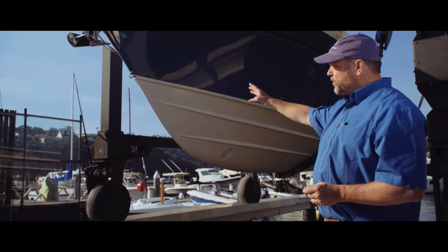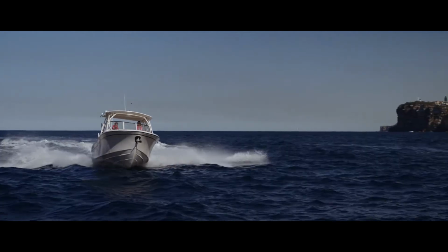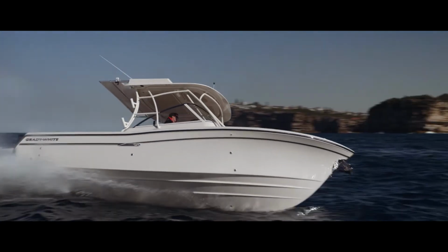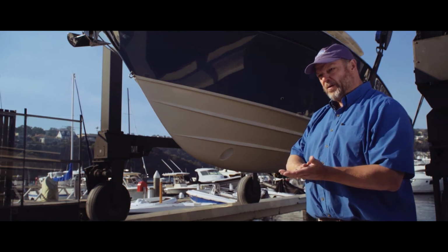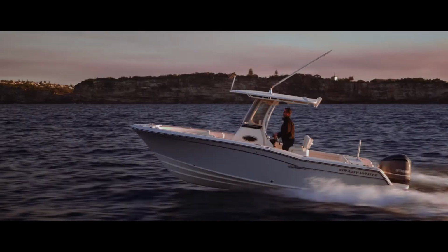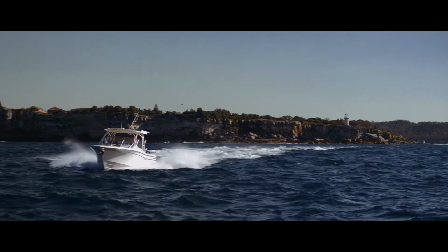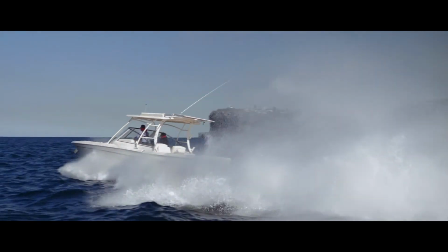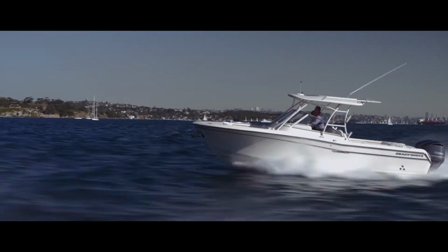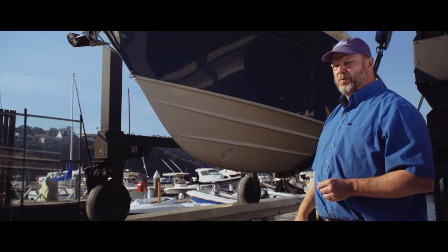The reason I'm bringing this up is because you can see the rake in the bow, the stem of the boat. It's not an accidental angle. It's not there just for aesthetics. It's the right amount of angle and it's the right amount of flare, the outward orientation of the hull as you go up above the waterline, so that as the bow buries into a wave, not only do you pick up buoyancy, but the shape of the hull gives you lift, dynamic lift. Because what you want to do is get the bow back up again so that you're not slowing down too much and you maintain control. If a bow plunges too deeply into the water, the bow turns into a rudder, one big rudder fighting against 2 or 3 little rudders back aft that are your outboard engines. So the balance on these boats has been perfected over the years.